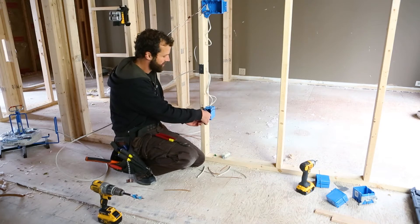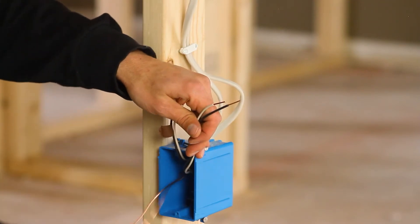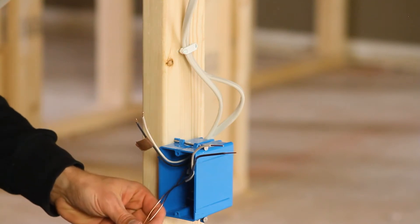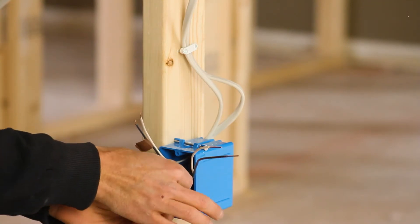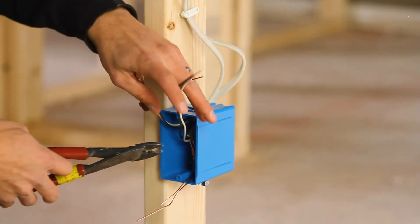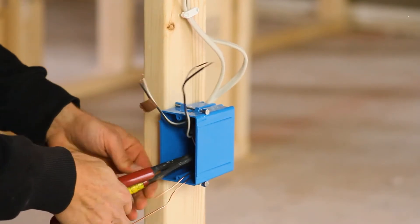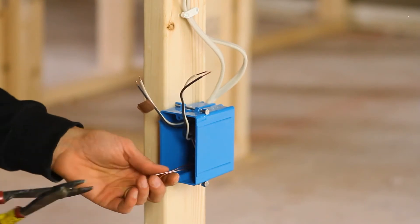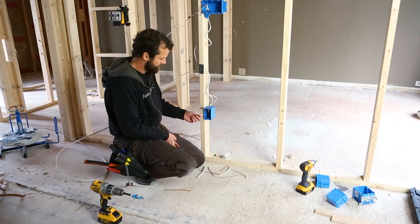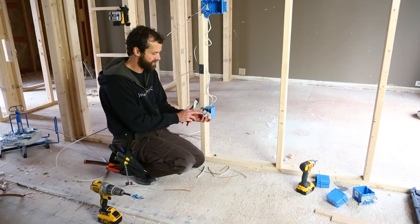I'm laying my conductors in the box so they're not twisted and wrapped around each other. I'm gonna slide that crimp sleeve — just a small smooth copper sleeve — over both grounding conductors. I'm gonna use my crimp tool, my diagonal cutters with built-in crimpers, to firmly secure that crimp sleeve over both grounding conductors. I'm gonna cut off the shorter of the two, since there's only one terminal on my GFCI receptacle for grounding conductors — that's the green screw.